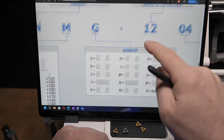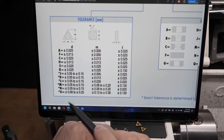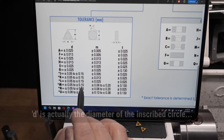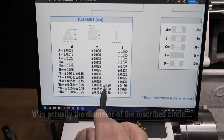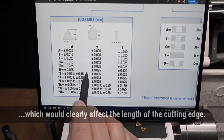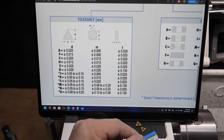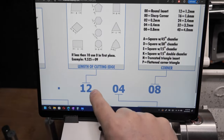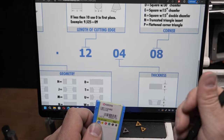But also maybe the M tolerance is allowing for that, because I do note that if I look up the cutting edge here, D, 5/100 to 15, so 0.15 millimeters. And over here, this value, M, which on the triangle is all the way to the top, 0.2 millimeters. That's quite a bit, a fifth of a millimeter, right? So adding all that up, yeah, I can see how you might not get to 11. But we're going to keep it exactly the same. That's the whole point.